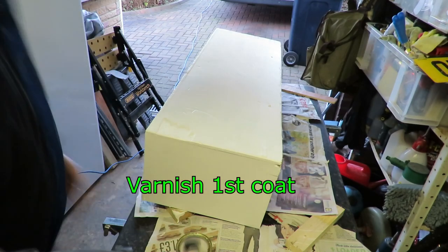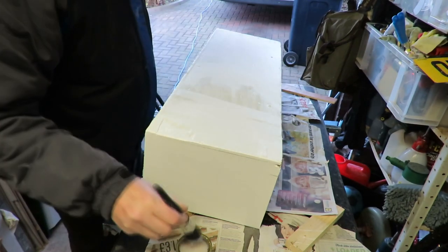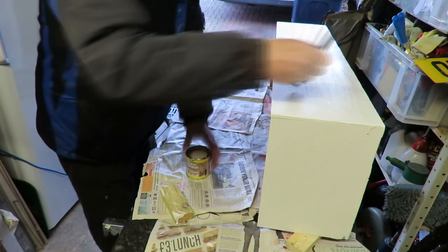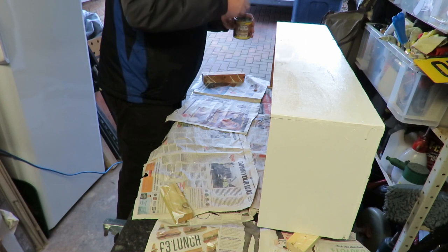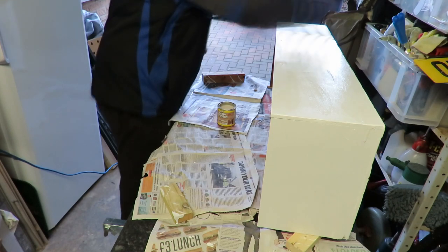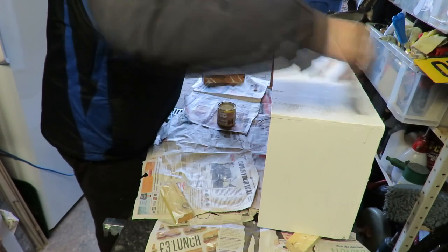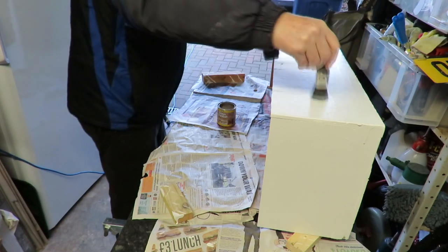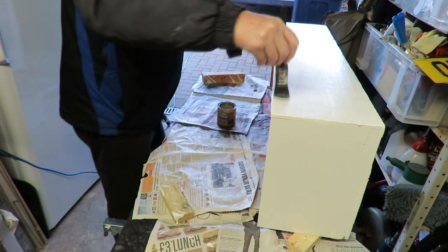I left that to dry overnight and now I'm going to give it a coat of varnish. This is water-based varnish — this will just protect the paint, stops it discoloring as much as it would normally, and also protects it against chips. There's nothing worse than if you've just painted something and then you bang it and it takes a chip out. When you've got as much on as you want, just use the very tip of the brush and go in one direction with very light pressure — this will just take out any ripples.